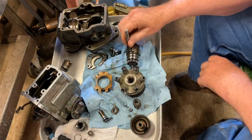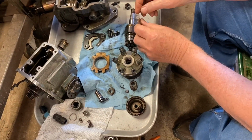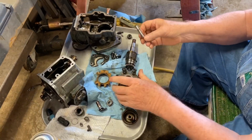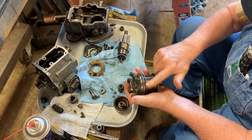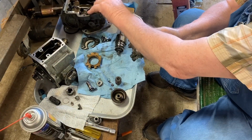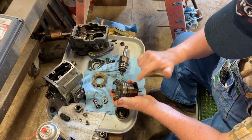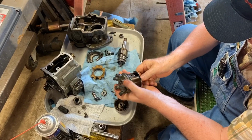This is going up and down off of the cam. And that's what's compressing, and not really compressing. You can't compress a liquid, but this is what builds up pressure. Once this gets past the port closing, you have fuel all around this, inside of this housing right here. And fuel's going in here through these holes, through ports that are drilled in here.